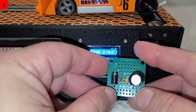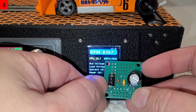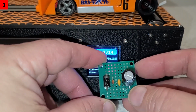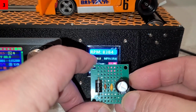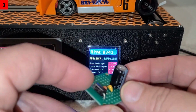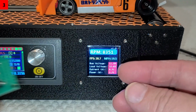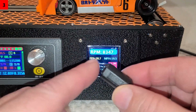First, a fast-acting Schottky diode ensures flyback voltage during braking and stops does not dump back into the system through the power lines. This diode allows positive current to pass, but clamps down immediately if negative current is detected. Next up is a 3-part capacitor noise reduction power conditioning section. This stage uses 3 separate capacitors in parallel to smooth out high-frequency noise in 3 different overlapping ranges on the power lines. The capacitors were selected based on oscilloscope readings of many popular slot car motors and the noise they produce. Next up on noise reduction is a high-frequency ferrite core choke attached to the main power lines to soak up any remaining residual noise on the line.